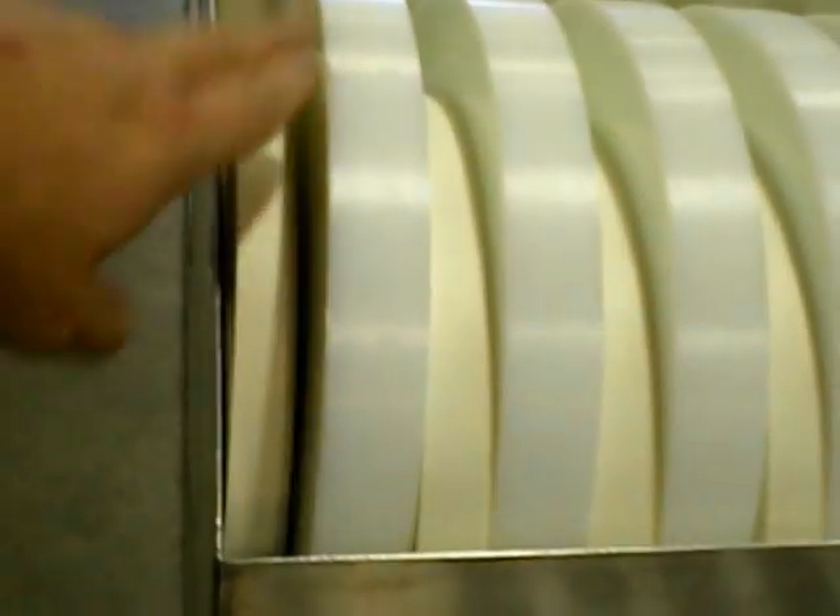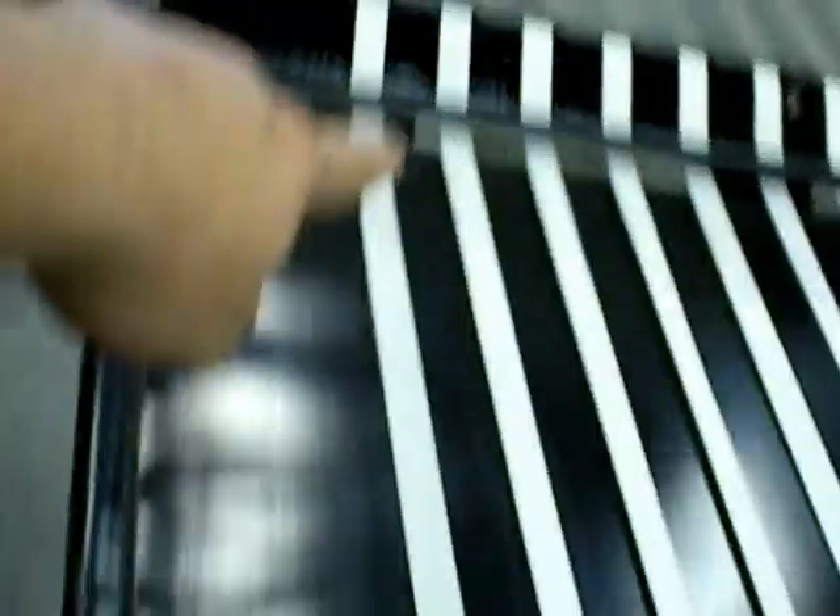Here are your 12-up lanyards running from this feed bin. You just throw in your roll of lanyard material and your spacer roller, throw them in, and feed them through these bottom slots on the bottom of this bin under this Teflon roller to get it level across. These rollers are adjustable so you can move them up or down to have more space underneath.